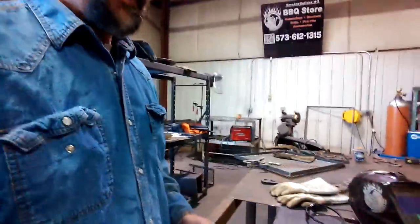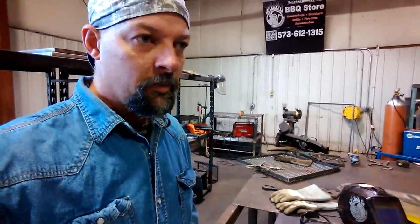The one thing that's helped me out the most with cutting along a straight edge with a plasma cutter is to make sure you don't rest your weight on the plasma cutter gun. Keep your weight on another part of your body — just like you're welding, rest your fingers on something. Be consistent in the motion that you're making, be consistent on speed, and you'll get a lot better cuts.